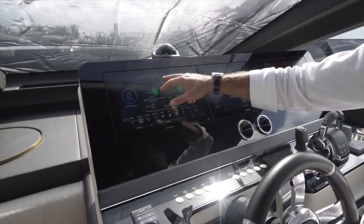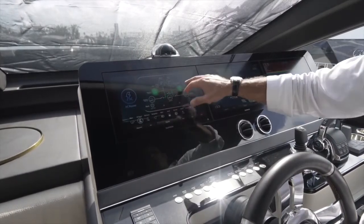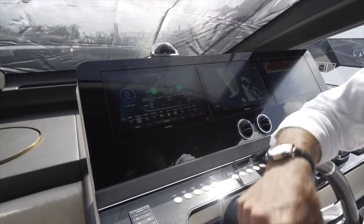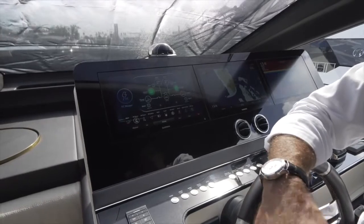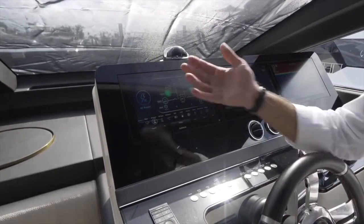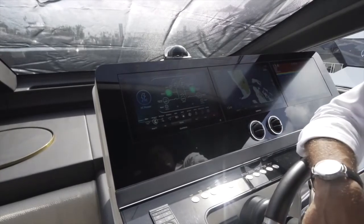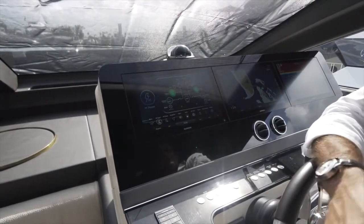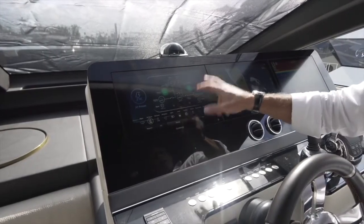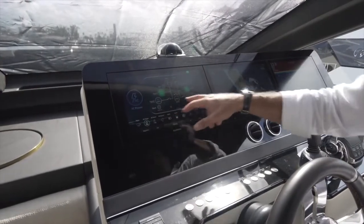This has 214 volts with an amperage draw of 16 amps, 210 volts, 17 amps. Don't pay too much attention to the voltage. We are at the boat show, voltage is very weak. Imagine the amount of boats which are connected to the network right now. So that's why it's not that clean. You don't have that good voltage here. It's just because this week is very demanding from a power standpoint. You can start and stop your generators from here.